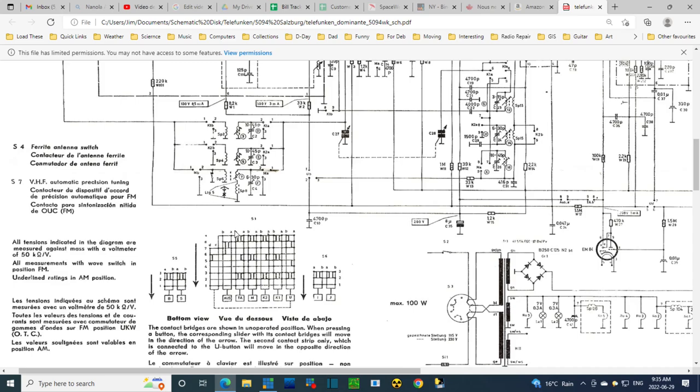So another thing to note is the small a and the small a and the small b here, and the numbering 1, 2, 3, 4, 5, 6, 7, 8, 9. So for instance, on the TA push button, wouldn't be surprising to find a switch labeled TAA 9, 8, and 7. With the button up, this diagram is valid. So you'd see that 9 and 8 are tied by this jumper here, if you like. And over here on this side, on the B side, same thing, 9 and 8 are tied. We're just concentrating on the A side right now.